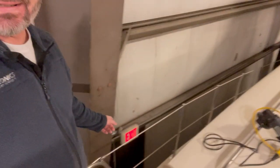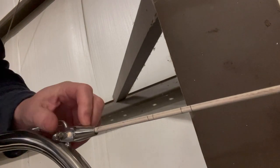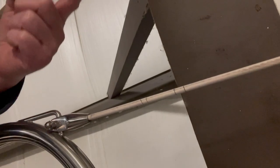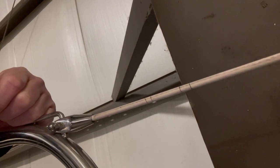That didn't work obviously, so let's cut to a couple weeks later where I go back up to the boat and get the lifelines cut off the boat in a successful, correct way. In order to get these off — these are stainless steel — I'm going to have to use a cutoff wheel. I'm just going to make a cut right here at where the old wire goes into the toggle. There's enough tension on this that it's not going to sag when I go through, and it shouldn't whip away once I get through the cut. After I make the cut I'll bring the toggles home, cut the other ends off as well, and there's a little swage in here that will need to be pounded out so I can put new lines in and new swages.